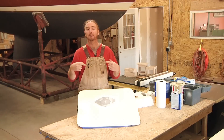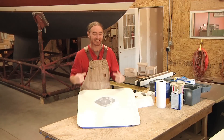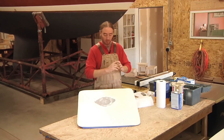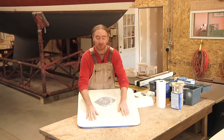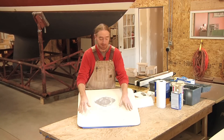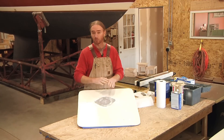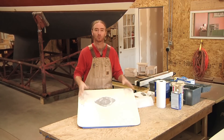So who's ready to button up this project and move on to something else? This guy. Here's what we're going to do: first we're going to wipe off all this old gel coat swatches from our color matching, then mix up our color match gel, lay that down, let it cure, wet sand it, buff it, and then we're done.